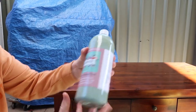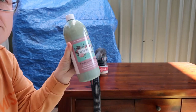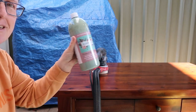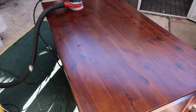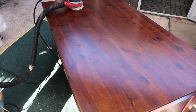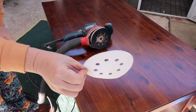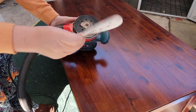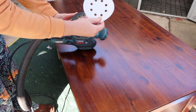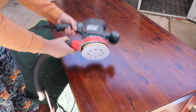So I'll go Vintage Bird. The Vintage Bird is a mineral paint — it's got a built-in top coat but it's a matte one. So what I'm going to do is wax this. First things first, I'm going to sand this with a 120 grit. I get these disc pads or sanding discs from Sleek Brushes Australia — this is a 120 grit. These discs are really good quality, they last well, so this is my new go-to place. Highly recommended.